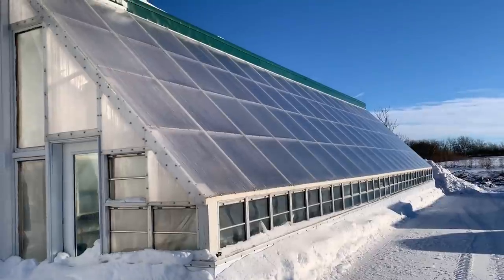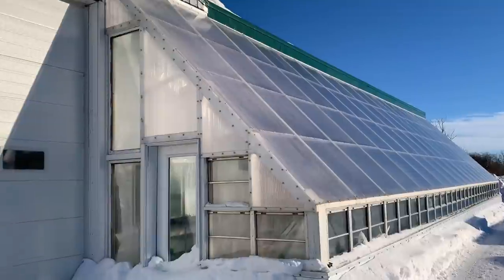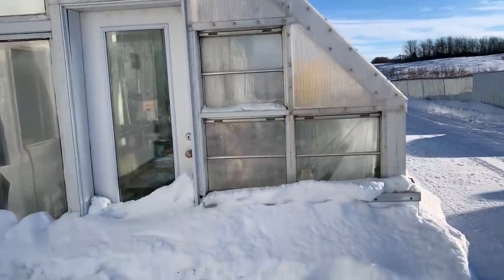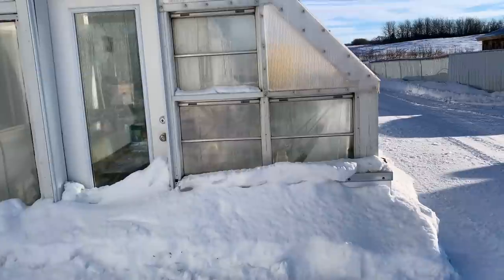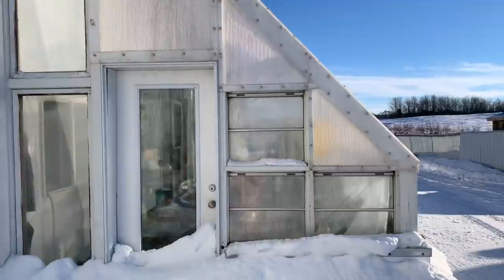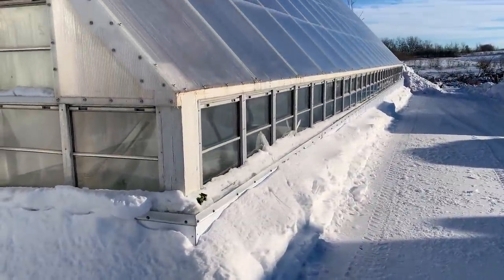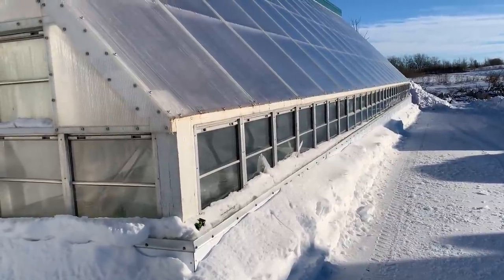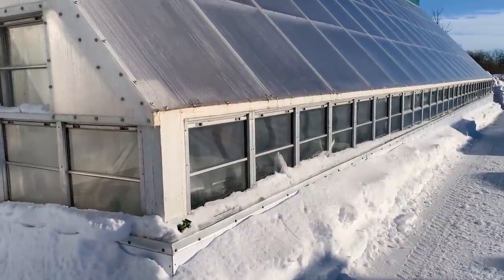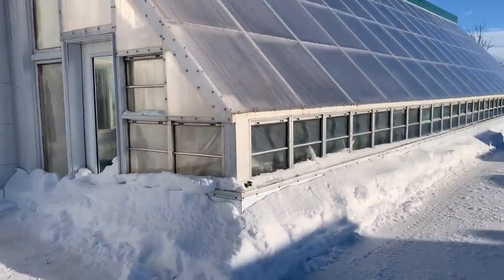On the outside is twin wall polycarbonate. I did it at a 45 degree angle — all of the structure on the south side. The whole front has a four foot raised bed to the height of the windows, so you can grow things quite high in there. I did it with a three foot pony wall and then used bus windows. I can open those all from the outside instead of the inside, so I'm not reaching over the raised bed. You just walk along and open it up in spring, summer, fall — every morning and evening you can get to it easy.